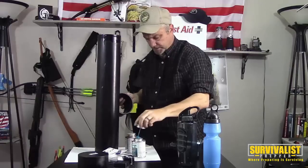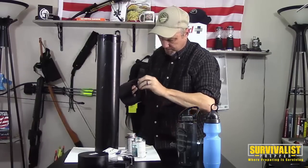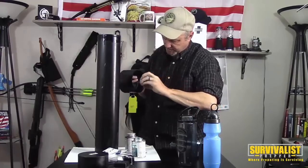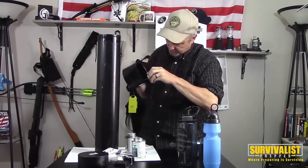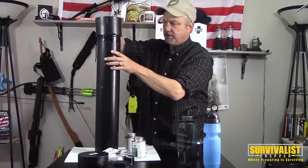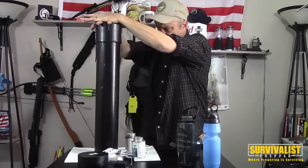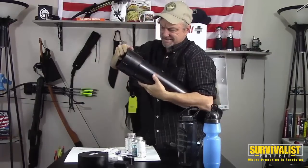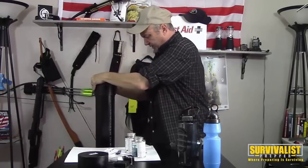We'll put some on the inside here. I want to make sure to get it all around it. You want to stay away from the threads though, because you don't want any stuff in the threads. And then we'll take and put this sucker on. Push it down nice and tight. And what we want to do is give it about a quarter turn, if we can, to get that nice and sealed in.